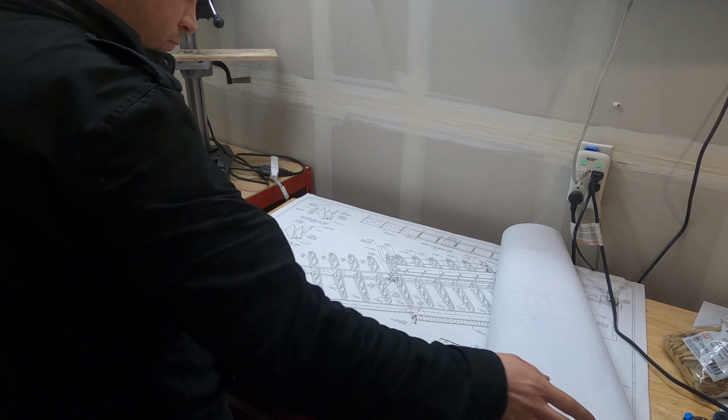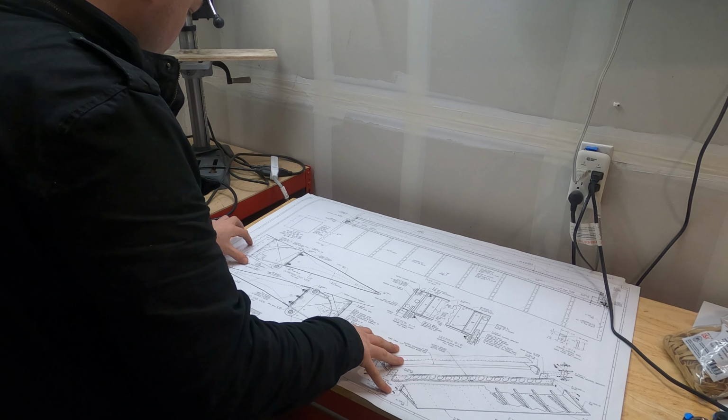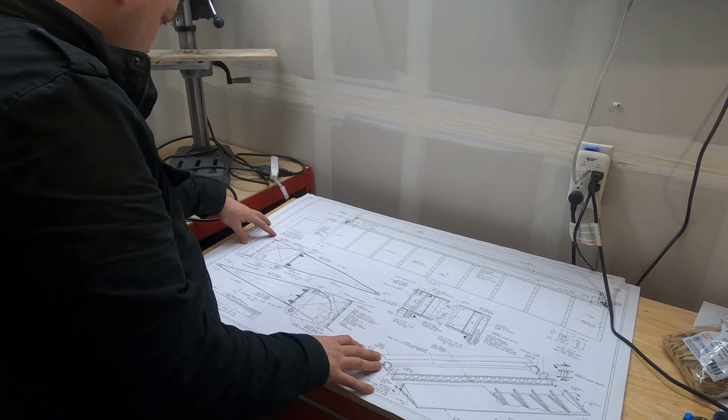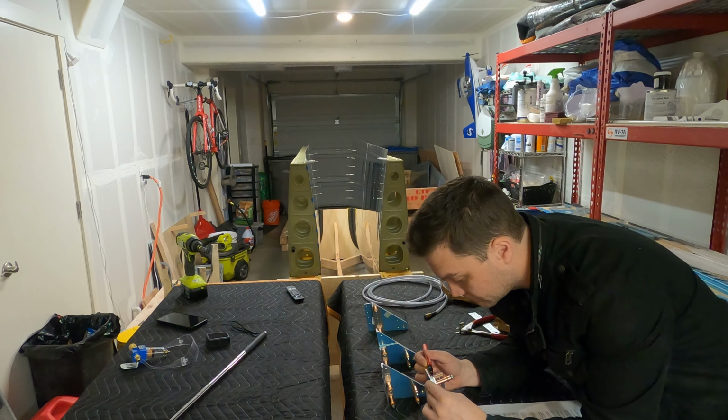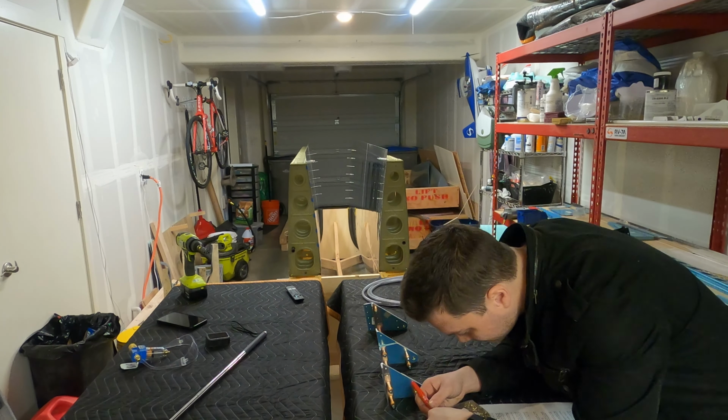It's really pretty simple. They didn't drill the holes at the factory because that would create a unique part number. Why do that when I can drill the holes as I make the airplane? Makes sense to me. As I'm doing that, I'm also marking all of these pieces where I need to heavily deburr or radius corners or countersink certain holes.